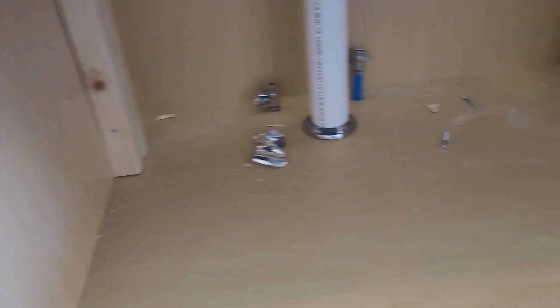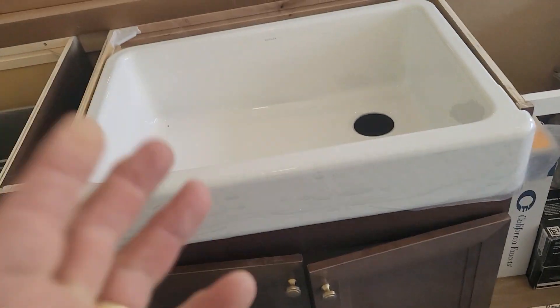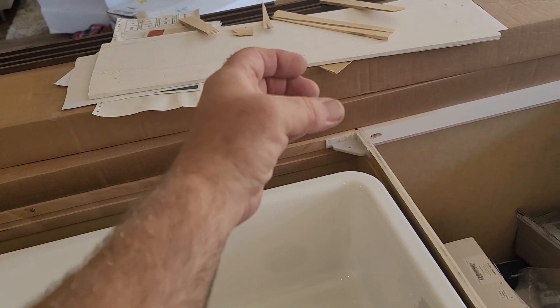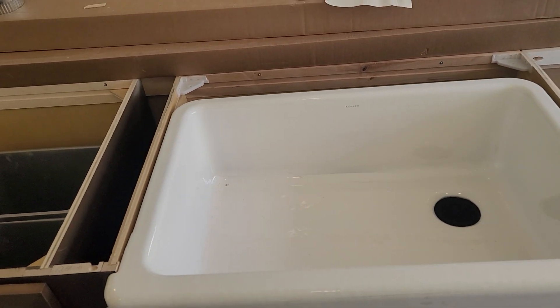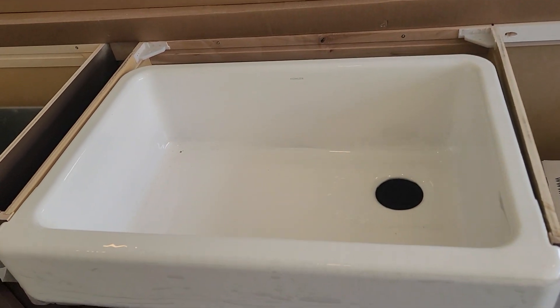One leg is under that piece in the bottom and the other piece is on the front to screw that piece in the back together to it. We put our doors and stuff back on for that. She asked about a temporary setup — this is in place and it could be hooked up to plumbing if you want to go ahead and put in a disposer. You could take a piece of plywood and cut it to go back here for your faucet, but it would be really easy to cause a lot of water problems if you aren't careful. I wouldn't recommend hooking the sink up at this point — maybe do the drains, but as far as the faucet and all that, you're going to have a real problem with water exposure to the face of all your cabinets.